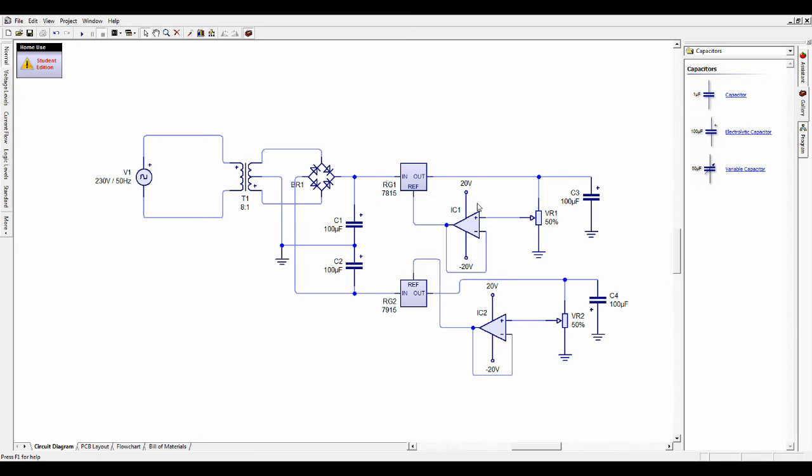So bear in mind when powering your op amp that it should cover positive and negative voltages if you've got a dual supply like we're designing here. If you're designing a single supply, then by all means just use 0 volts and your upper unregulated voltage here.